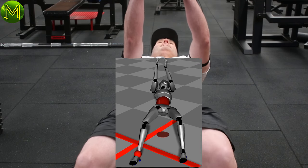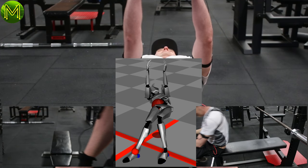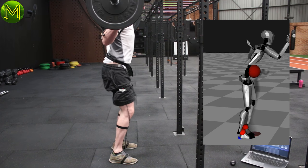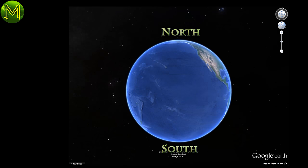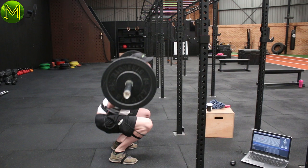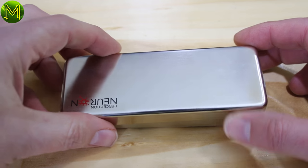The second problem with IMUs is noise. Some exercises came up with great captures, like the dumbbell bench fly — notice I used a different bench, which had less metal in it than the previous bench. You can see what happens when I do a barbell squat: a big lump of metal placed on my shoulders with a big metal squat rack nearby makes my squats look like a ballet routine. So why is this happening? It's all about magnets. The Earth is one big magnet with a north and a south pole, and the IMU suit makes use of this as a crude triangulation method. It's actually fairly accurate, but the magnetic field is so faint that large metal objects will affect the sensor readings — not only metal objects, but phones, computers, mains power, and anything else that emits electromagnetic waves. In fact, the Perception Neuron team are so worried about it that they provide a magnetically shielded case to house the sensors.